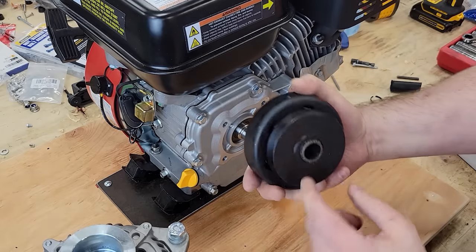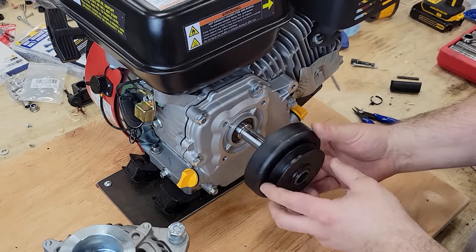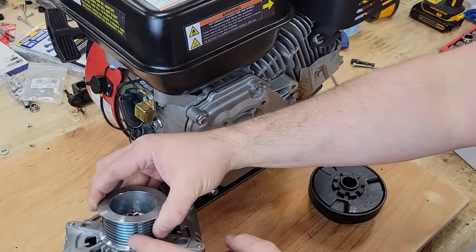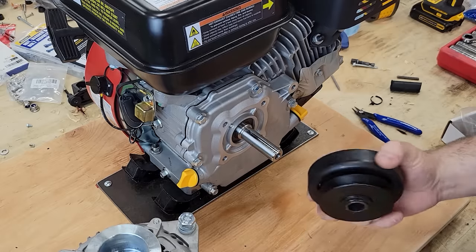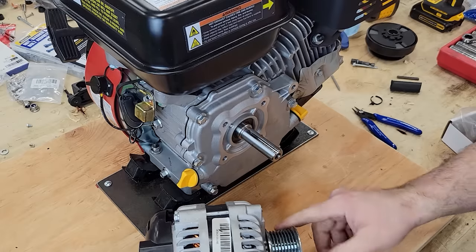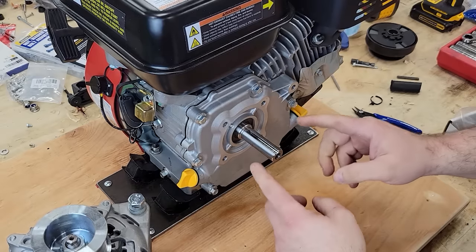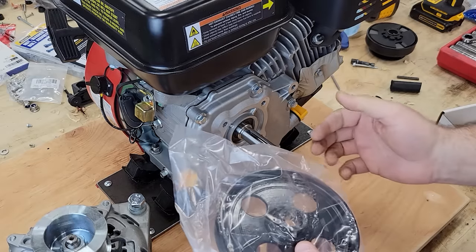I could use a V-belt like this. This is a clutch with a V-belt and it fits the 3/4 inch shaft, and I could replace the pulley on the alternator. And that's commonly done with a lot of projects that you'll see out there. But I didn't want to do that. I really wanted the high surface area of the serpentine belt. So instead, I found a serpentine pulley, and I'll leave a link to this in the description below.